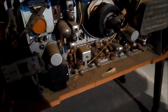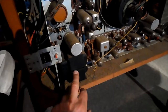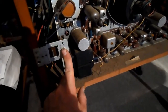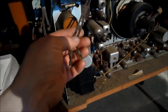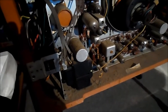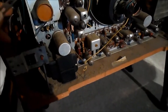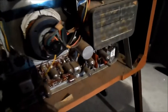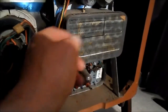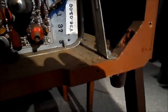Much to my surprise, it happens to be a transformer powered set, which is a nice feature. Circuit breaker. The UHF is the slotted twin lead and the VHF is just the non-slotted. We'll put those aside. High voltage cans - it's similar to a lot I've seen. The chassis number here is V360300.